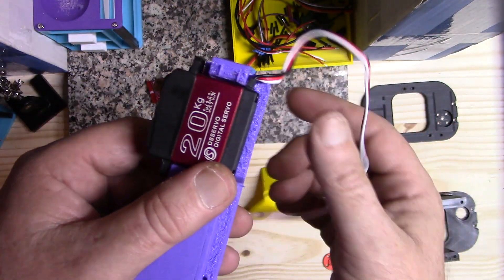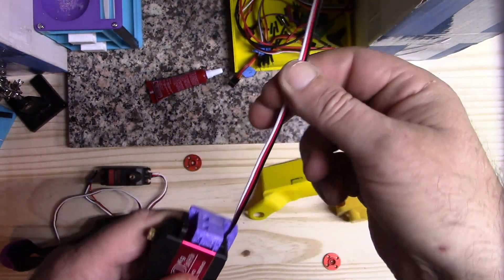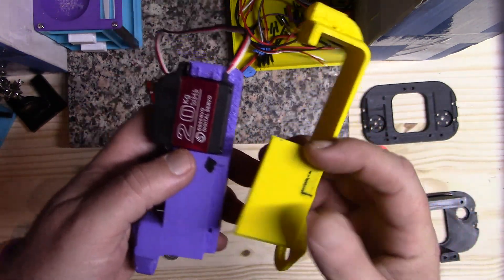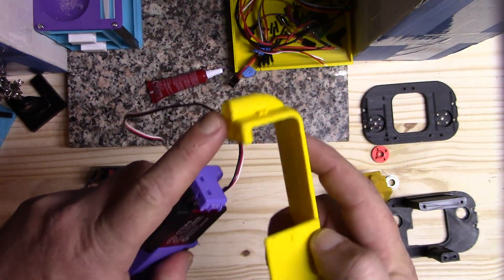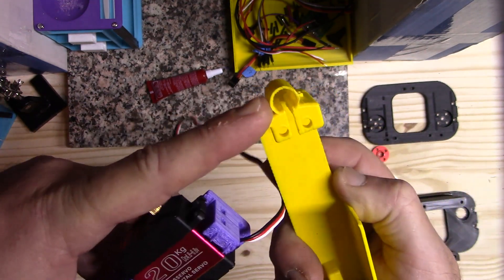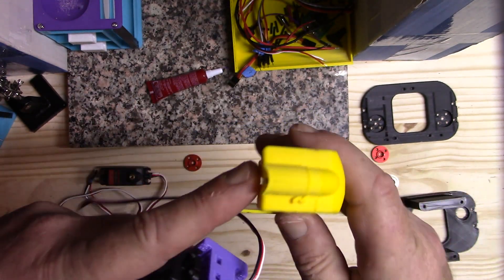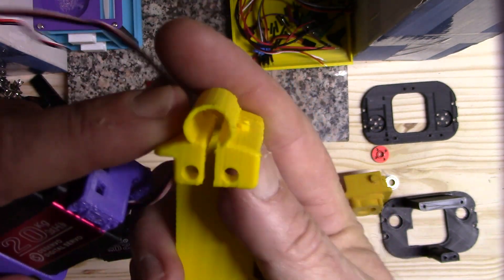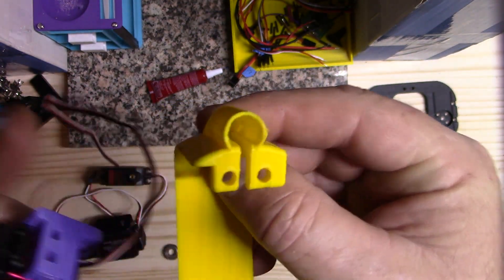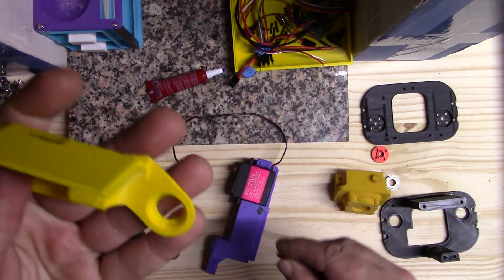The cover has to slot in here before you put the remaining screws in. The tricky part is getting these two pieces together along with the wires chased up through the tubular wire chase. I made that a more difficult channel than the original hole, but it looks much cleaner. It's a fragile thin wall when removing support material, but it comes out nice — I've only broken one in the dozen legs I've printed.